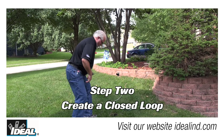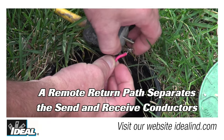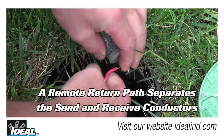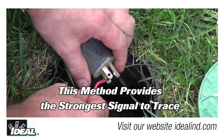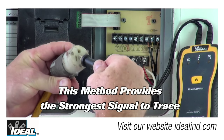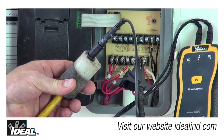To do this, I've taken a long extension cord and, using the adapters and leads included with the SureTrace kit, connected the hot wire at valve number 5 to one of the conductors in the extension cord and the far end of this conductor to the second output of the transmitter. This creates a closed loop and should provide the strongest signal to be traced.